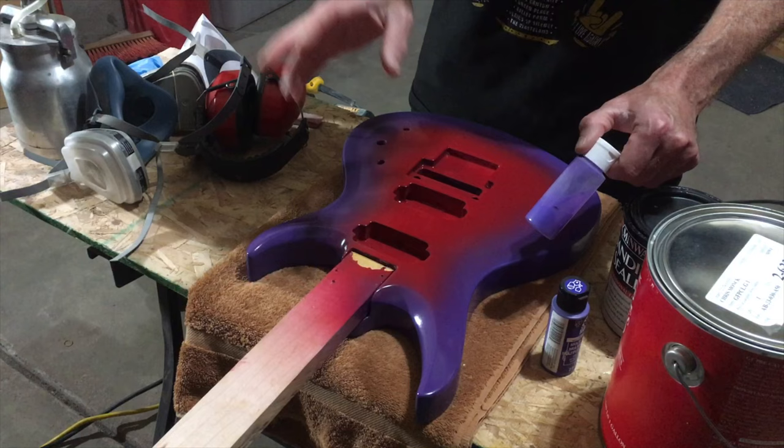So what I'll do is spray down a coat, and I start first thing in the morning. I'll spray a coat, let it sit for an hour, come back, and spray a second coat. I'll continue that way through the day until I have sprayed a total of about 5 coats of the clear. Then I'll hang it up and let it dry overnight. The following morning, I'll come back and sand the surface with 600 grit sandpaper. And I sand dry. You don't wet sand a water-based finish, because if you do, you reactivate the glycol that's still evaporating out. Instead, you just dry sand, and I use a stearate, no-load sandpaper, and sand the surface, get it completely smooth, and remove any runs, drips, lint, dust spots, that sort of thing.